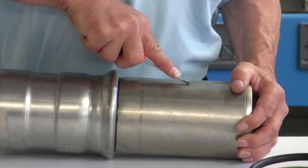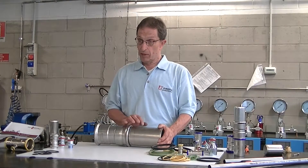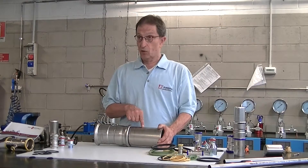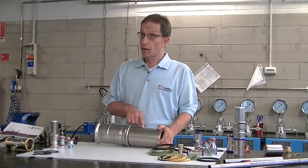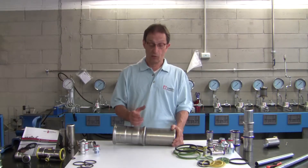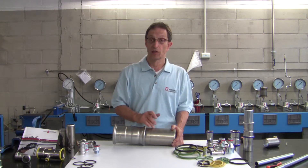If there are marks on the surface of the stainless steel pipe, there is an interruption of the chrome oxide layer. Normally, there are no impediments to the reformation of the oxide layer, except in certain conditions as seen previously. So, with time, the chrome oxide layer reforms.